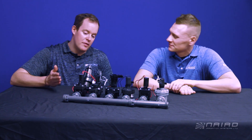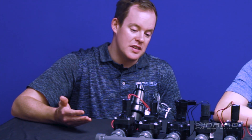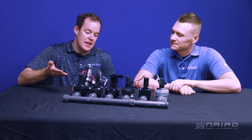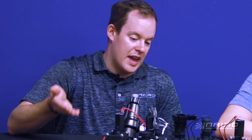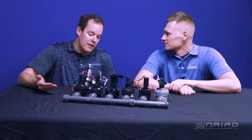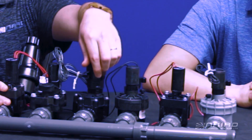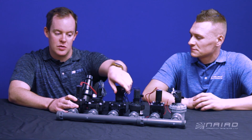That's a great question. What we've found over the years is that air behaves differently than water. When we're winterizing a system, we're using air, and what we found is that while a valve may close with air, it won't necessarily stay closed when we introduce water in the spring. So what we suggest is go open up your bleed screw and your solenoid, and then make sure that they're closed tight.